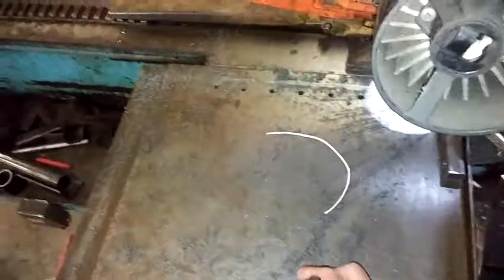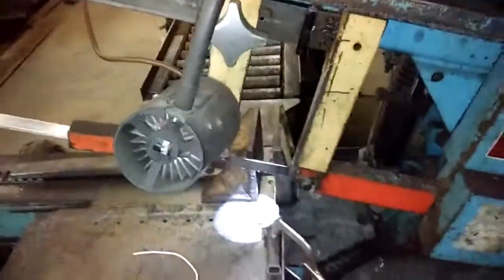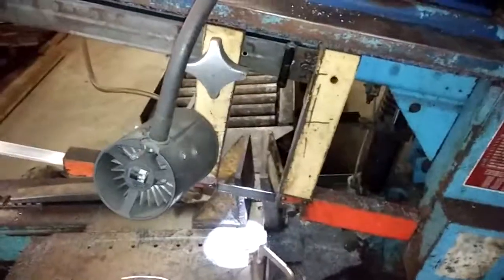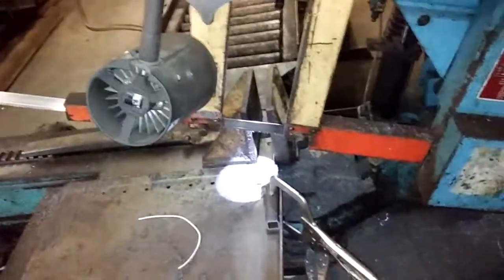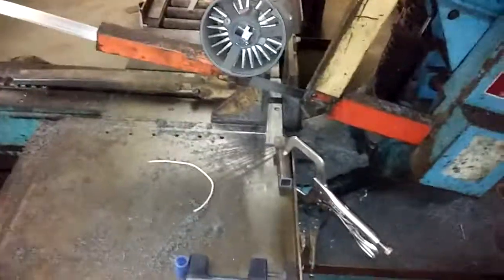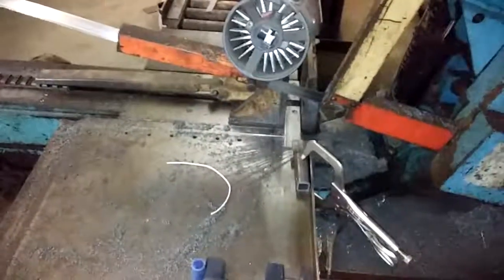So all manufacturers are probably a little different, but if you're creative, you can use something similar to this to set up your metal bandsaw with a light to cast a shadow of that blade, and it will knock so much time off of a big production job.